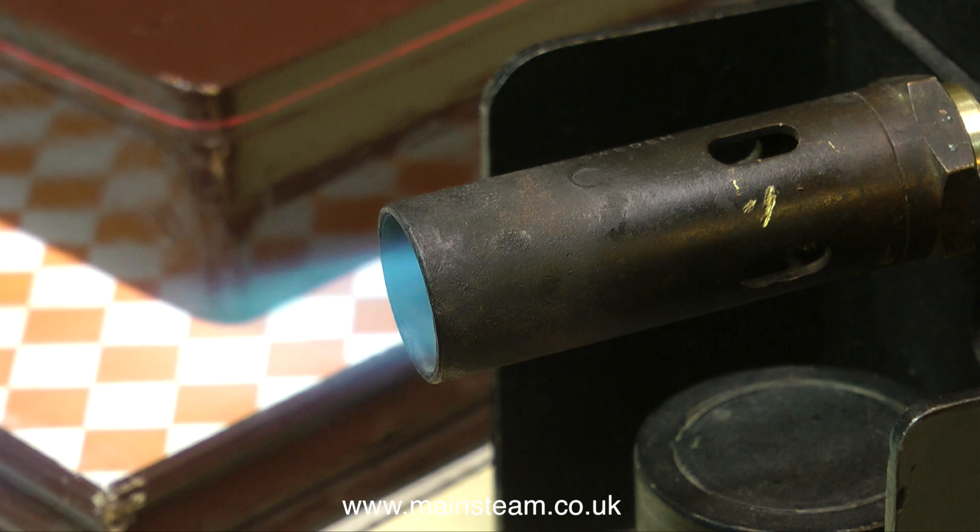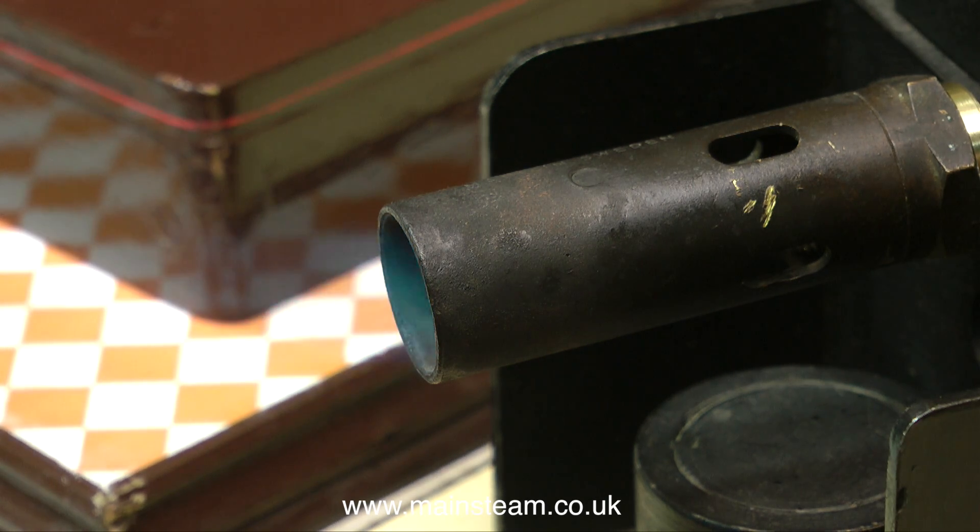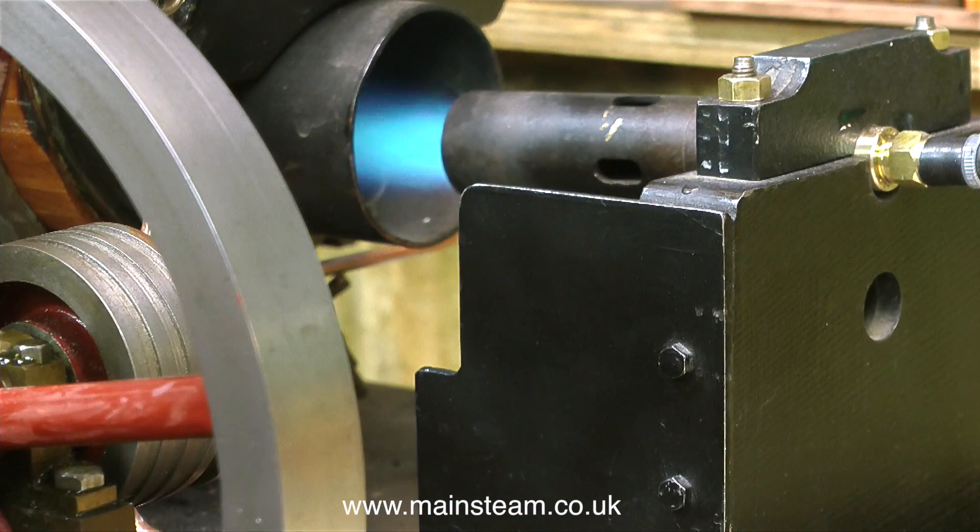This is a much smaller flame. These are of course designed for propane via a regulator. I don't use propane for model steam engines, and in England I'm told you're not allowed to use propane for firing model steam boilers. I'm using the commercial canisters used on picnic stoves — these are 70% butane and 30% propane. The problem is they chill very easily; as they chill the pressure drops and the whole performance of the gas burner alters.